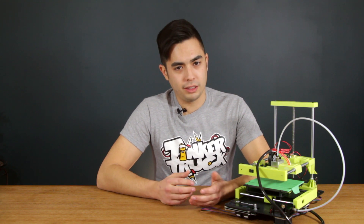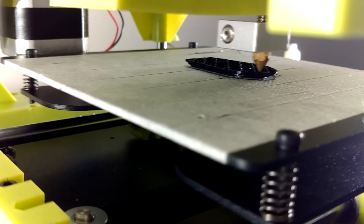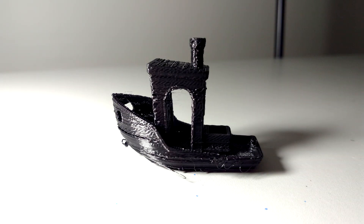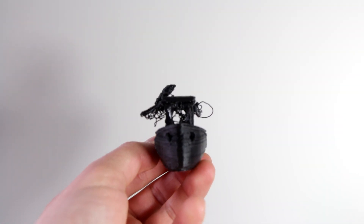This could be slightly remedied with offsets, but it was such an imperfect solution that it was just easier to forego the auto-leveling and use an old-fashioned paper-leveling method. What followed was a long, long process of trying to get this printer to make anything worthwhile. I could get the printer to lay down a flawless first layer, but at some point most of the prints gave up in one way or another — whether it was under extrusion, which was likely caused by the version of Cura I was using at the time, layer shifts, or simply stopping partway through a print for no apparent reason.